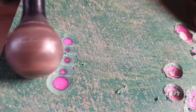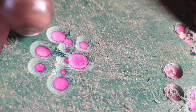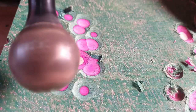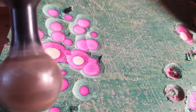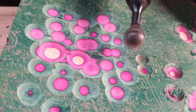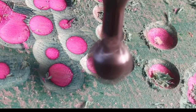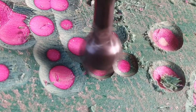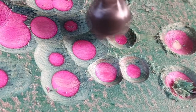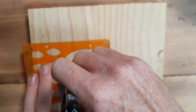Now doing some texturing on skateboard wood — the second layer is pink as you can see. This is actually the large ball gouge just to give you a feel of it, and it really goes through the wood nicely, probably taking out wood faster and maybe cleaner. Now with the smaller ball gouge you can see it's leaving smaller holes, which is quite obvious. I think it's quite clean, and once you finish you can lightly go over it to take out that tear out.